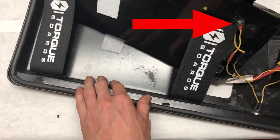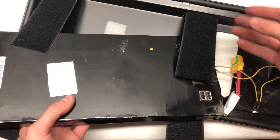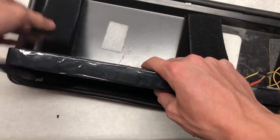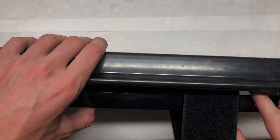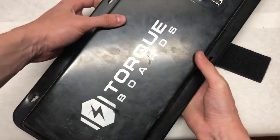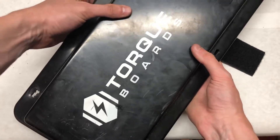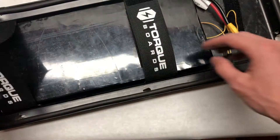We've had this build for a while now and are just making the video now, so you might notice some extra wires connected to the battery — the charge port broke off, just ignore those. It's a great battery, but it is 6S, which is why we have to use the 260KV motor if we want any speed. One nice feature of this battery is that it came with a free enclosure for USA customers, and it also has a built-in percentage indicator, power switch, and USB ports.